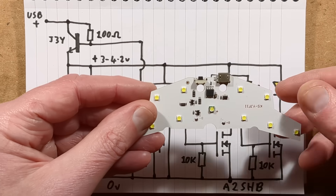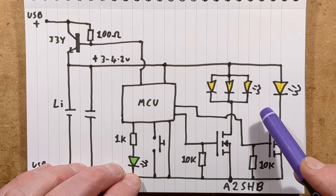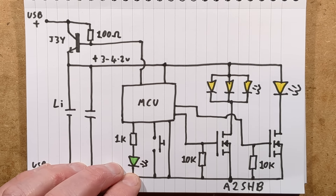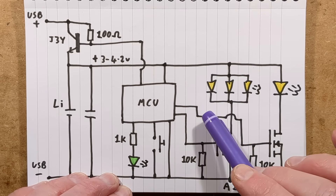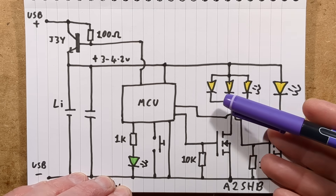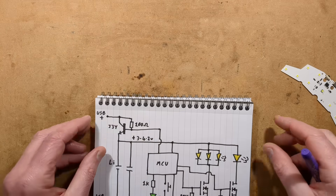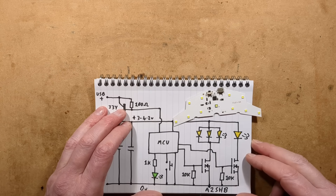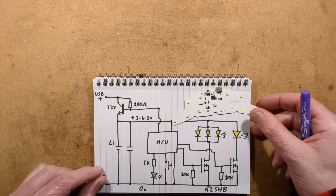The large cluster of LEDs — how many are there? There are 10 LEDs over here, and then just a single LED. But there's no current limiting, so once the cell has finished discharging I'm going to have to connect it back to the circuit board and use the DC current clamp to see what current these actually draw. They are just solidly turning on with no pulse modulation, so the current could actually be quite high, relying on the lithium cell's internal impedance. As these things tend to do — but anybody designing higher-profile equipment might not consider that to be acceptable practice.